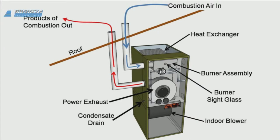If they're done right, they work well. Okay. There's certain situations where, even in their installation instructions, they'll tell you that you may need to put an additional pipe on the end to discharge the flue gases away from the intake. Right, because a lot of these... So that depends. They're really particular about how you terminate these things in the instructions. Yes. Now, the one I see get screwed up the most is probably the one that Trane has, the bay vent, where they flip it around, and they'll put the exhaust on the intake and vice versa, and it just spills right around and freezes up in cold environments.